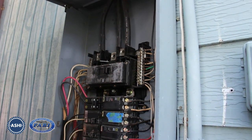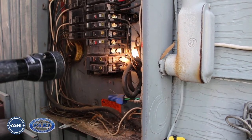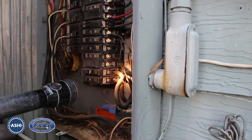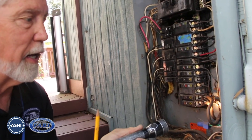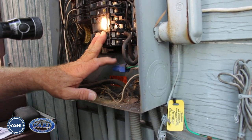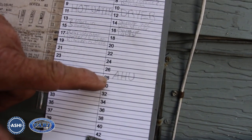All of this is non-metallic wire — it's all copper, all decent. We have this one feed here which looks like it's aluminum but it's not. This is another type of conductor to watch out for — I've termed it copper-clad wire over the years. It looks like aluminum on the outside but if you were to scrape it, you'd see copper underneath that coating. They're also very hard to bend. This one we believe feeds the air handlers up in the attic, and the label says AHU. Going around, we're most likely going to be looking for some kind of subpanel up there.